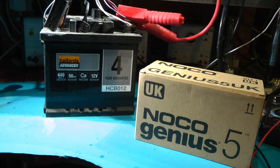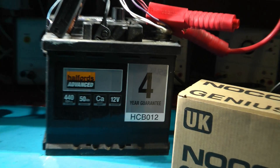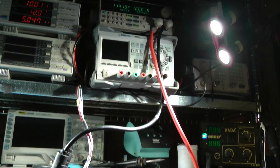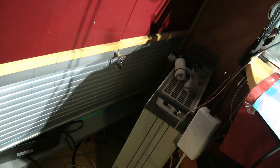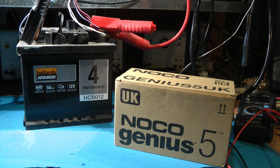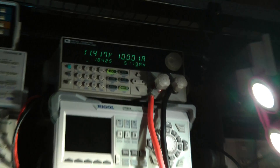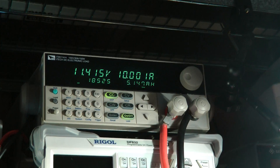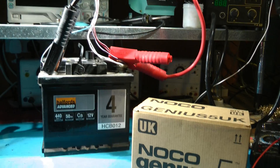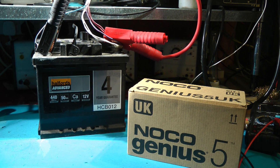If the Noco regen makes no difference on this partially degraded battery, we'll try some more drastic regeneration methods I've read about online. For example, I've got a one-kilowatt DC regulated power supply, so I could give it a real dose of current for a few seconds or a minute and see whether that makes any difference to actual capacity. If there's anything you want me to test, let me know and I'll try to incorporate it — that's what's coming over the next three or four days.